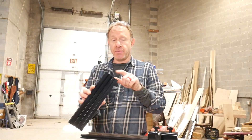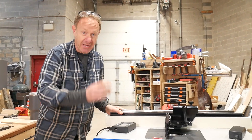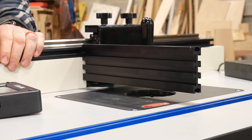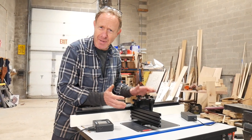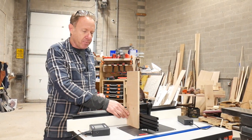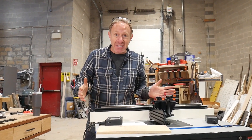What's left now is just to put the actual miter plate on here — minus the router, of course. The miter plate itself has three different levels. The instructions say the middle, but we're going to choose the bottom. One of the first things I noticed was how high this miter plate is off the table. Typically on a miter we want to be closer to the fence, but this is a router table — we don't want to hit the bit. A lot of the stuff we're going to be doing will have the wood upright. The ability to set the miter fence up higher to clear the bit makes all the sense in the world. This is why I'm really, really excited about this product.